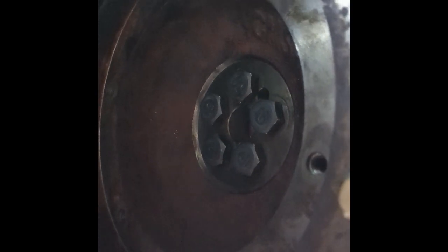So you can see the 5 bolts in there. 1, 2, 3, 4, 5. Yeah, so 80 to 86 Newton meters is the torque spec on those. All right, as I continue, I will try to update.